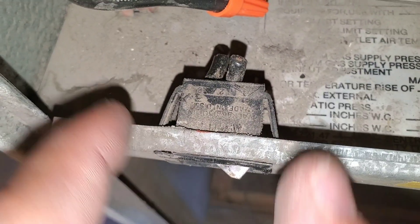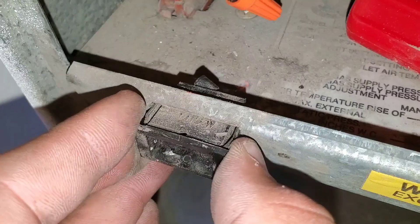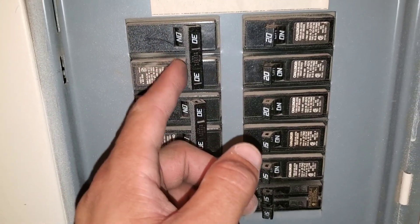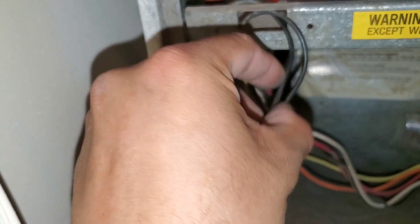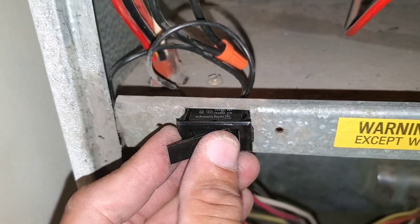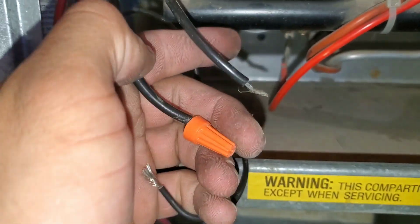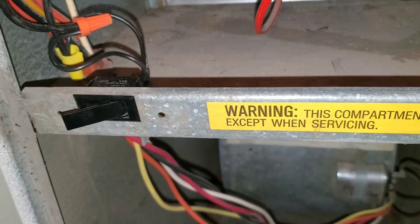On the inside you have two little inserts — compress those inserts and push it through the panel. I did unplug and de-energize my system. You may have a switch to turn to the off position, or you can find the breaker that corresponds and turn that off. Feed all wires in and gently compress those inserts on the side and push in. Now that we've installed our door switch, this will allow us to properly work on the system safely.